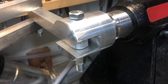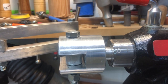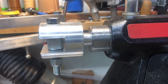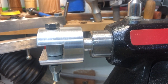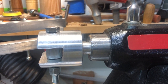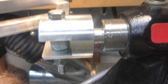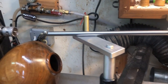Everything was really easy except that part, which took a long time because the Morse taper is zeroed in to about one thousandths. I think the next version will not have a Morse taper, but will probably use some kind of pre-manufactured taper, and maybe a half-inch piece that fits into one of the commercial ones — it just took a really long time. But overall, it came out real nice and I'm real happy with it.